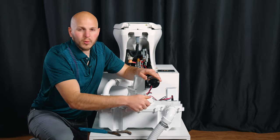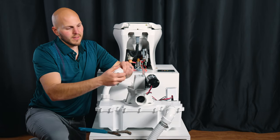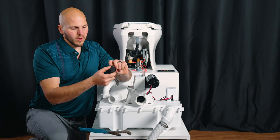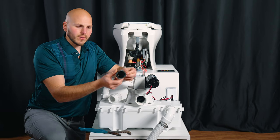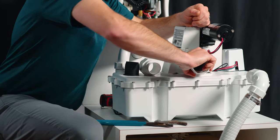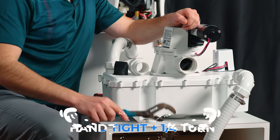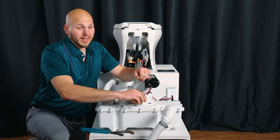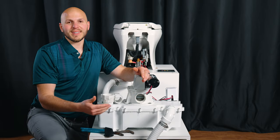Try not to destroy these fittings — they're a right-hand thread. Something to be aware of: this is what happens when you over-tighten them. This is a training display we use with students. It's quite difficult to see, but the duckbill valve is actually damaged and that can cause issues. The spec on all of these fittings is hand tight, back off a quarter turn.